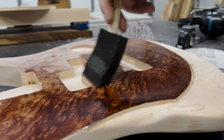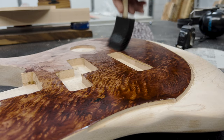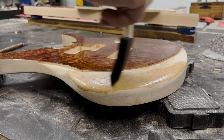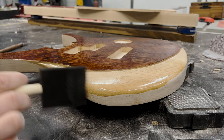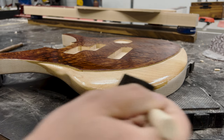We sanded the body with 500 grit sandpaper and applied Osmo's Gloss Polyx Oil. We were hoping for a deep gloss to really accentuate the grain without using a polyurethane. You want to make sure you get a good even coat across every surface of your work. It'll be better for the wood, the finish, and your sanity.